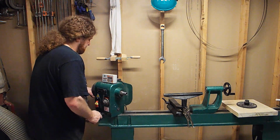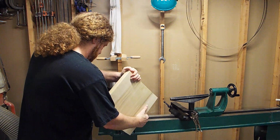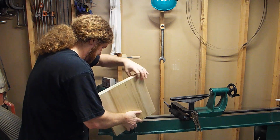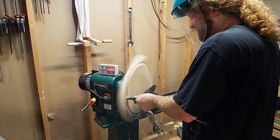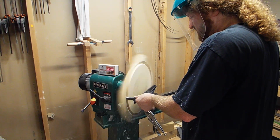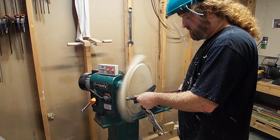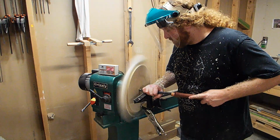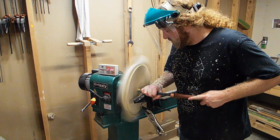The cool feature of my current lathe is the outboard turning feature. I turned the headstock at an angle and extended the tool rest so I could work on the face. In retrospect, thinking of turning the corners off was not such a good plan, but it did give me a good set of lines to cut at the bandsaw. I also flattened the face so I had a good parallel face to the handplane surface.